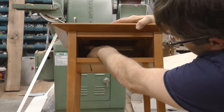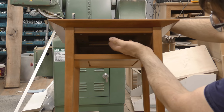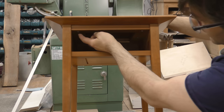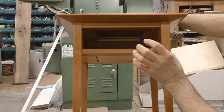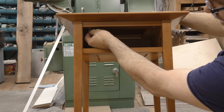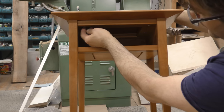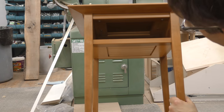So this screw and this screw, which are at the halfway point, are in a hole in the frame, the same diameter as the screw. This screw and the two back ones are in larger diameter holes in this piece so that there's room inside for it to move seasonally. The big washer out here is what keeps it nice and tight and allows that to slip.